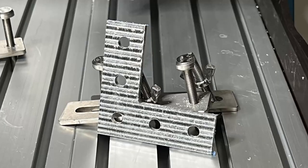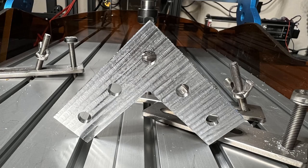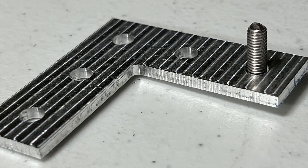This part looks really nice. The surfaces and edges are much cleaner than parts made from the CNC-3018. The X-axis of the machine is more sturdy thanks to a 12mm linear rod compared to the 10mm rod on the CNC-3018. The shorter length of the X-axis — making this effectively a CNC-1830 — also means it can hold the weight of the spindle much better.